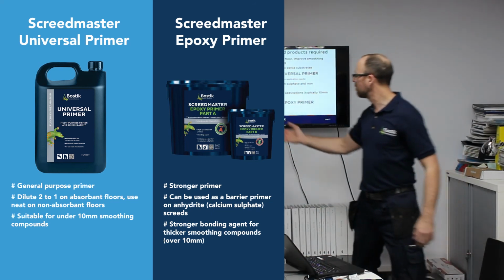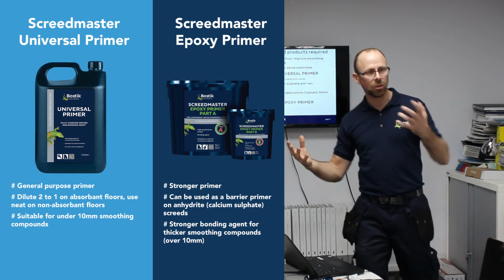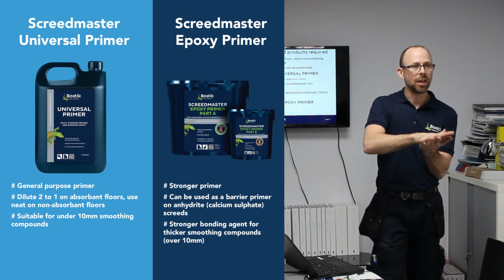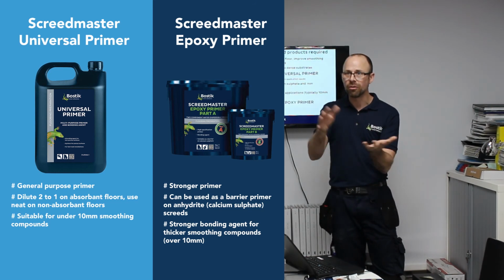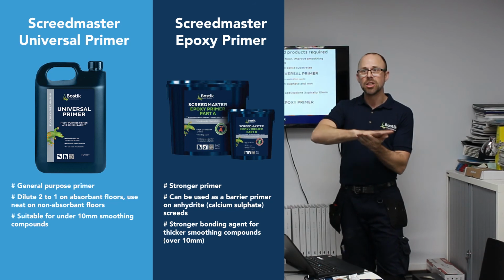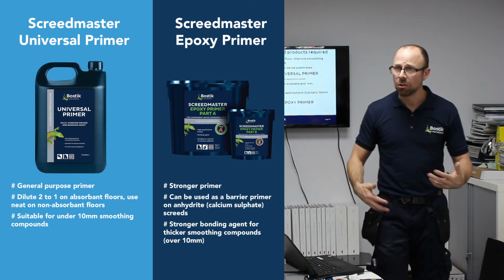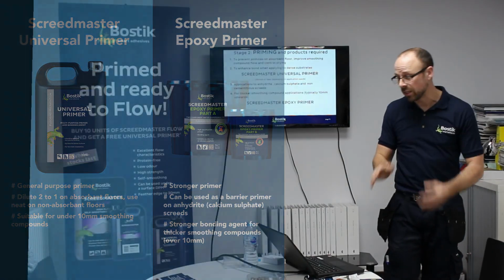With the anhydrite screeds, gypsum and cement don't like each other. So you've got gypsum in the floor, cement in the smoothing compound. You put the cement over the gypsum, a chemical reaction is going to occur, and you're going to get a formation of crystals between the two. It's going to pop off. So by putting the epoxy primer down, you create a barrier between the two. Then you can go on with your cement-based smoothing compound, and no chemical reaction is going to occur. So that's one of the things we come across quite often: poor priming, wrong primer used on anhydrite screeds.